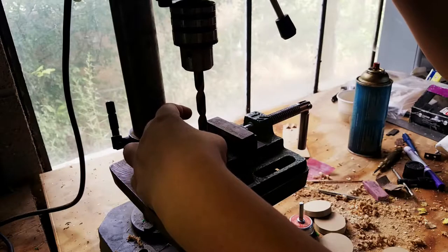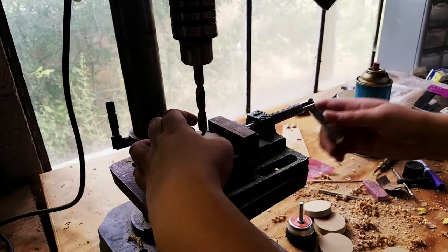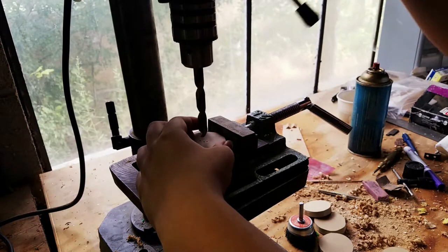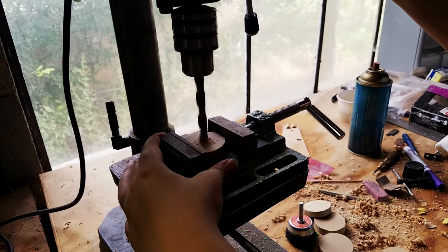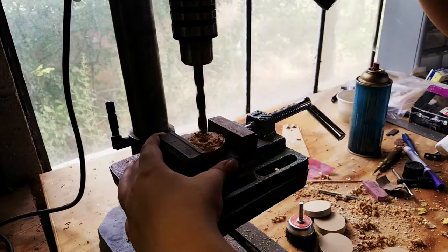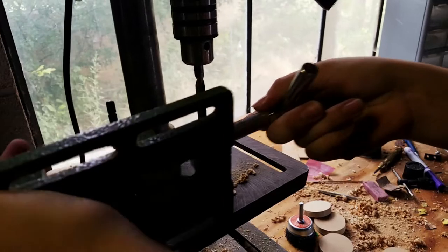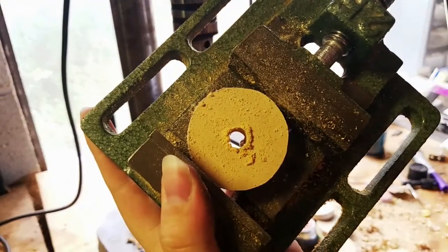And here is a shot of me standing directly in front of the miter saw as I cut them to size. I also added wider holes in those chair pieces for my dowel to go through, and it's important that these holes are wider than a snug fit, because the wheel needs to spin around. I had one large drill bit that I used for the dowels that needed movement, and then I had a drill bit that was the same size as my dowels for the things like the spindle drive and the wheel, so that it could fit snugly on the dowel.